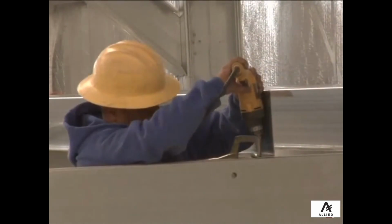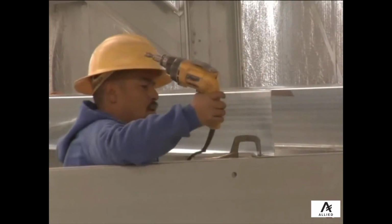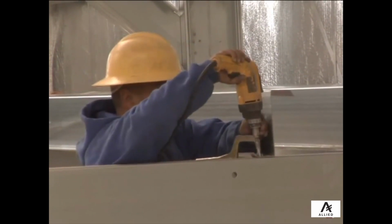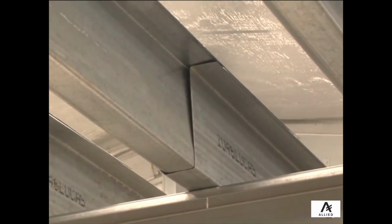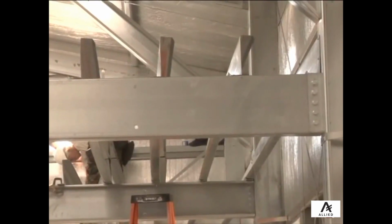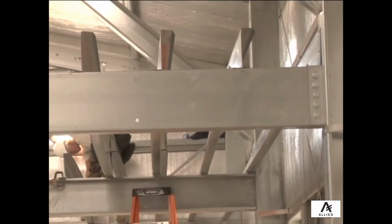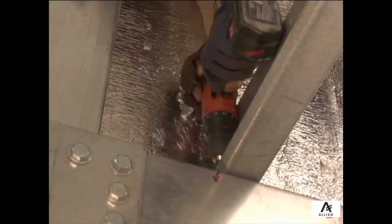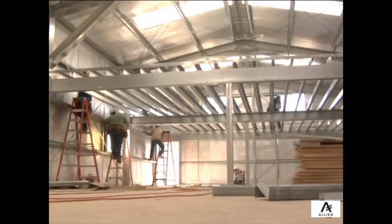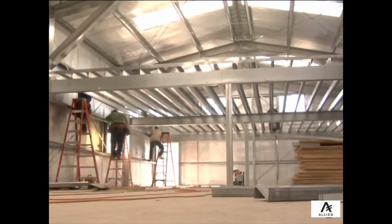Begin the first bay, placing the joist with the big flange down. On the second bay, the big flange will be up, so the joist will properly nest. Continue on until all joists are placed. If you are installing stairs in your mezzanine, you will need to alter your joist layout per the engineering plans.